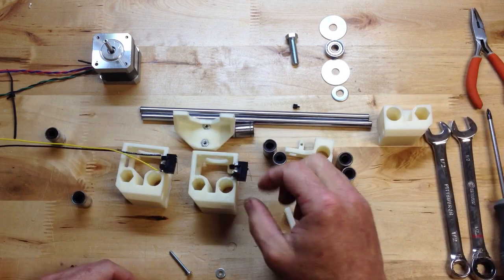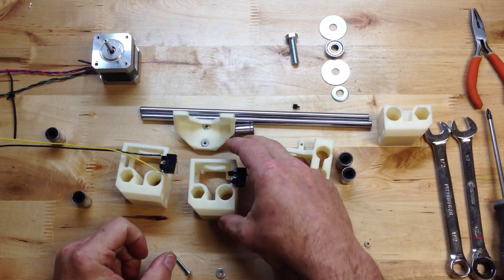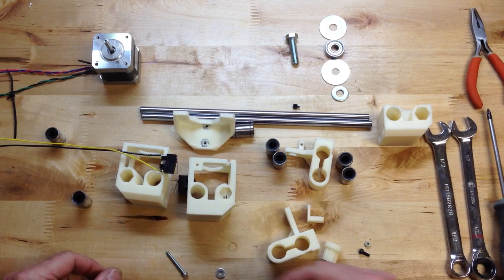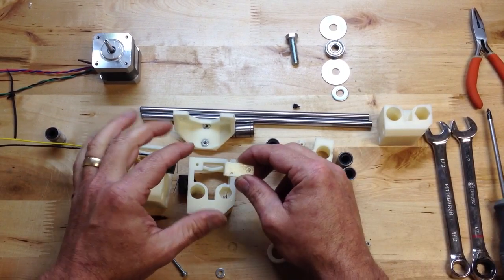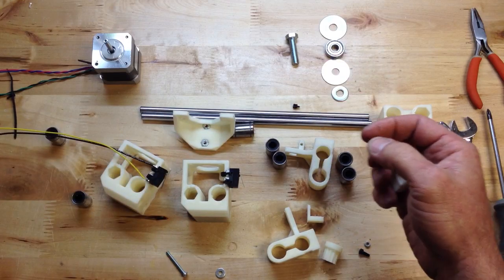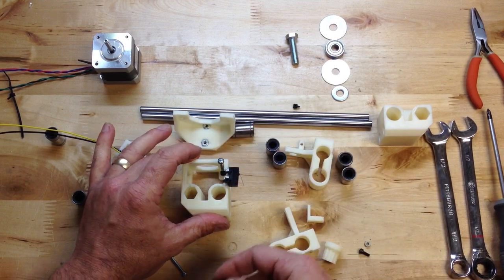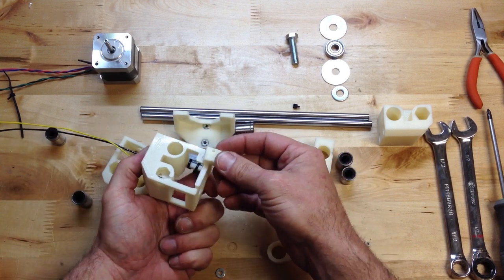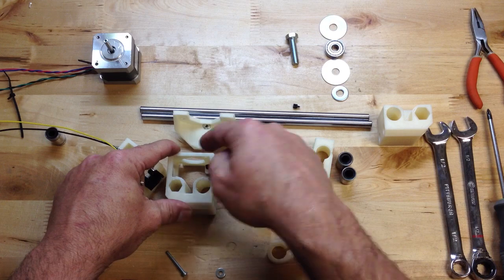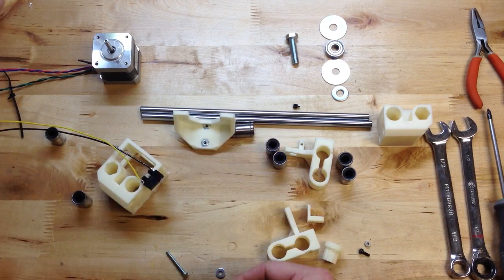You can see how that works. Now for the Z end stop, if you have an old part it's going to be a little more difficult to have a fix — you're going to want to print something to hold your screw. Something blocky to hold this screw, and you're going to want to glue it to the bottom here so you can thread that screw right down in that corner. There's not a lot of room, so you're going to want your end stop screw to end up somewhere in there. You could easily print yourself a little block on the bottom and utilize the X motor for both the X end stop and the Z end stop, but you're on your own for that — I don't have a file. I think that would work really well as a location, but on the new one we've already incorporated that.